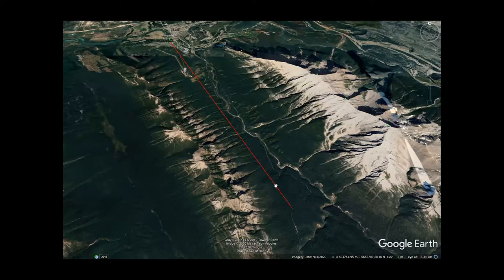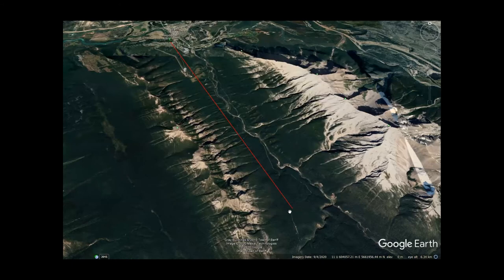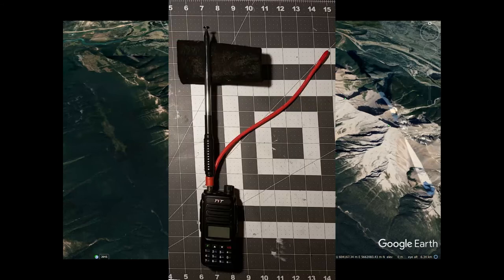In this test I want to focus on when I took the 2-watt TC568 on UHF and got to the furthest extent of range using the UHF stubby duck, which actually tended to outperform both the UHF duck and the 270A on high ground. The caveat is that in lower areas it's not going to work well at all, and that's where you'll want something more like the telescoping steel or the quarter-wave UHF rubber duck.